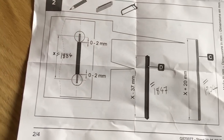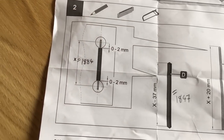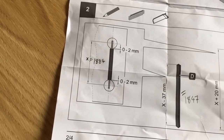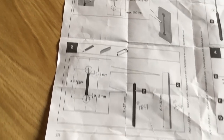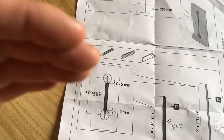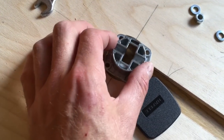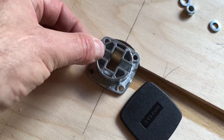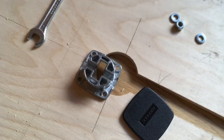The way the straightening system works: you adjust the nut at the top, which lengthens or shortens the threaded bar. Depending on the direction of the curve you're removing, you either lengthen or shorten it. The bar needs a bit of play within its slot — that 20 millimetre oversizing gives you 10 millimetres beyond the centre line at each end, so there's movement within the cup hole.